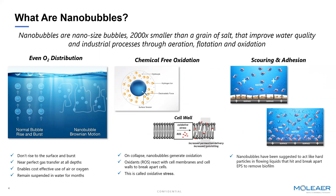In summary, when you're thinking about nanobubbles, you're thinking about two things: highly efficient oxygen transfer into water, making oxygen very affordable to achieve super-saturated levels; and the unique properties of these bubbles that remain suspended in water until they dissolve, providing oxidative benefits and scouring benefits to maintain a clean surface and a healthy body of water.